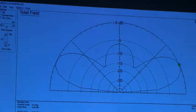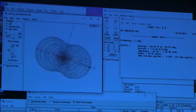therein, if you've got an antenna that's, let's say, east and west, and you want to work Europe, you're not going to, because all your power is going north and south. Do you follow what I'm saying? It's a mixed bag. Here, the orientation you got that dipole makes a difference.